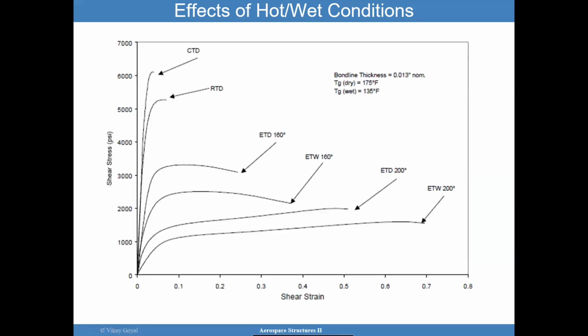And another picture illustrating that the stress strain curve even changes. So with metals, in some composites, you're used to the stress strain curve not changing very much for this temperature range that we're talking about. But with bonded joints, as you increase the temperature, now you could introduce even more bending at the joint. But maybe you have more ductility, so it kind of cancels out the potential for damage.